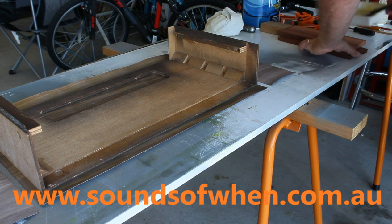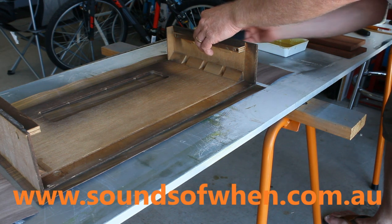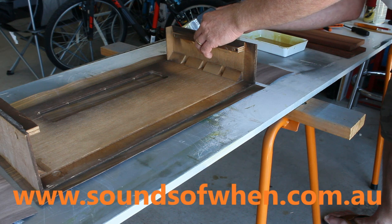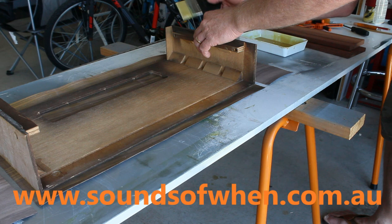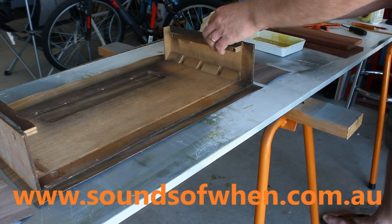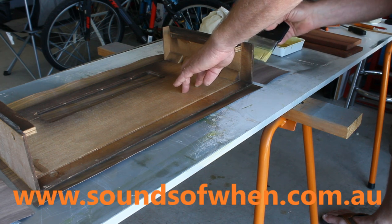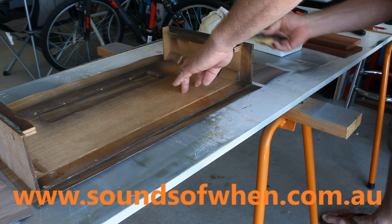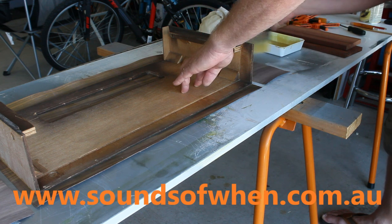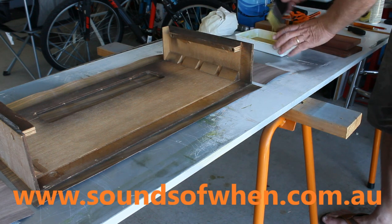Once again just applying the glue to the case itself. Just try not to fill the screw holes with the glue, because you're going to have to dig all that out later — try and keep away from the case mounting holes if you can. Apply a nice thick coat, paying attention particularly to the edge where it meets the other veneer. Make sure there's enough glue in there so you're not going to get problems. Okay that's one part done, and just wipe off any excess — you don't want bulging amounts of glue hanging around the junction between the two veneers.